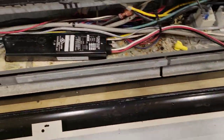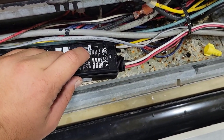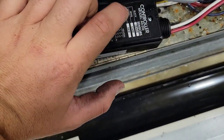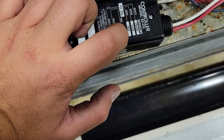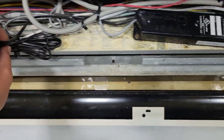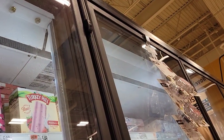The issue is door frame heaters not turning on. If you look at this, you can see 'frame' — black. This AZ20Z seems to be representative of this actual thing. So we have this black wire going in, then a white wire going in, and that's supposed to go to a case. Then we have a gray wire going in, and that's supposed to be a dew point. So the black wire going in the back — I'm guessing this goes into the door frame, and the gray one goes up there to that dew point sensor.